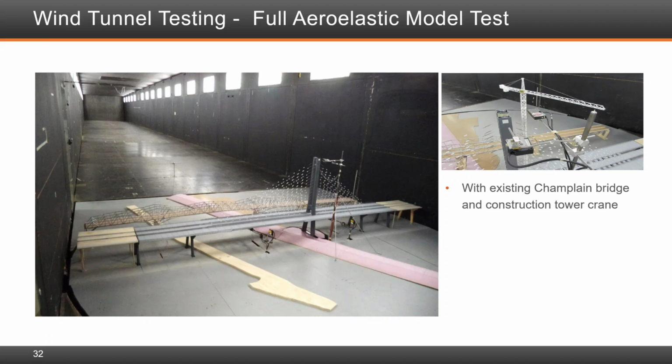We required nonlinear time history analysis. TY-Lin essentially went with an essentially elastic design, and we think we had, again, best practices requirements for seismic design. There were also independent peer review requirements by seismic specialists. So again, seismic was taken under high consideration, and that was fed into the design team, which developed it further.